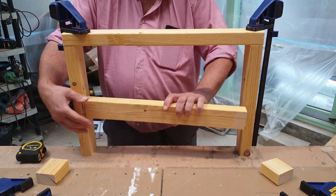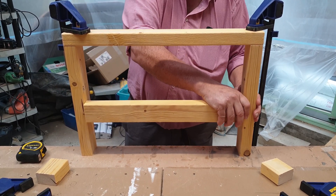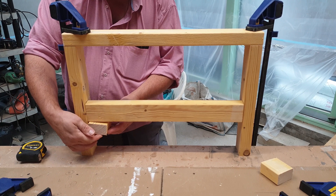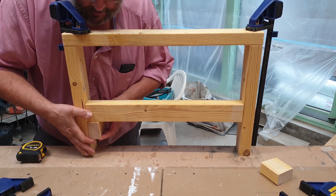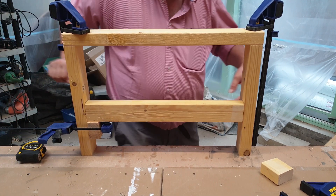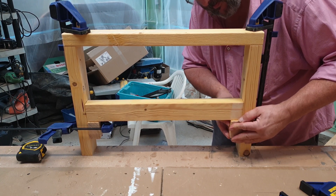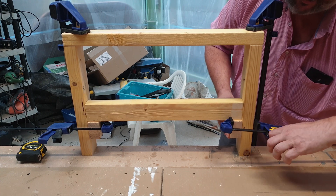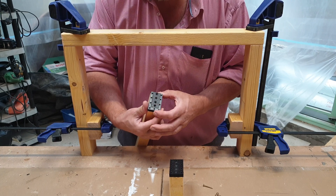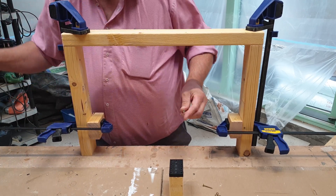I've rigged this up on my bench to mimic a situation where there is an opening to be bridged and no access from outwith the opening. If working on your own, or where requiring an accurate length is difficult, you can initially cut your timber to fit the opening so it's a push fit, allowing adjustments and marking of the finalised location. Once the sides are marked, cut 20mm off your cross piece. Holding the joiner assembled, screw the tenon into the end of the cross piece. Here I demonstrate on the bench with a short piece of CLS for viewers' convenience.